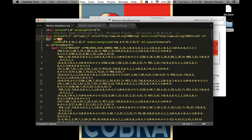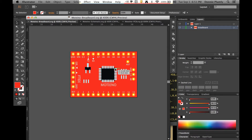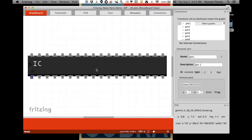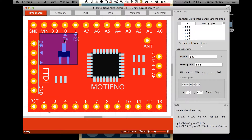We need to put a certain number there — I've been using percentages. Looking at this board in Illustrator's breadboard view, it's not a perfect square. It's about 34 millimeters across by 23 down, so roughly two-thirds by one whole. Remove the y value and set width to 100 percent, then set height to 67 percent to get the correct proportions when importing into Fritzing. Then go to File > Load Image, browse back to your file, and it imports at the correct dimensions.